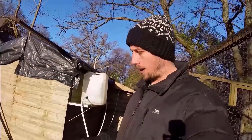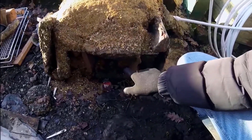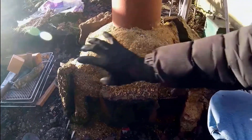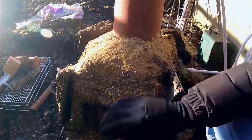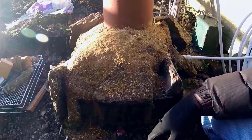So I'm rethinking the design, the finer details of the stove. What we have at the moment is the air gets drawn through here, through the fire, and comes out here. What we need is a grill — and I've got a grill here — so what I might do is take this all apart, put the grill at the bottom, and then take half the front of this off. So we can have an air intake at the bottom and the wood input up here. Then it will hopefully burn cleaner, because I think that's the issue at the moment — we're not burning clean enough.